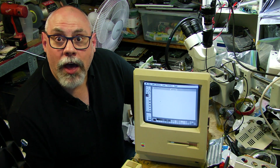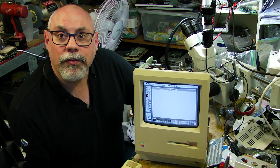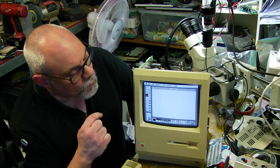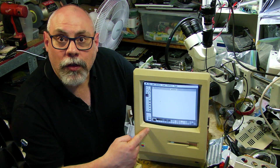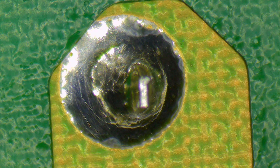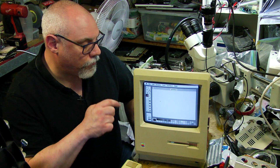So the 128K is alive. In the meantime I've done a few little housekeeping tasks, specifically I made a slight adjustment to the voltage — it's a little on the low side. I have adjusted the screen geometry so that it fills the screen now. There are a series of cracked solder joints on the analog board which I've fixed up.